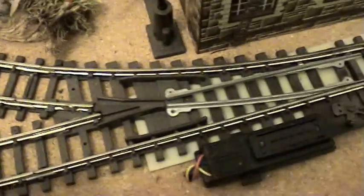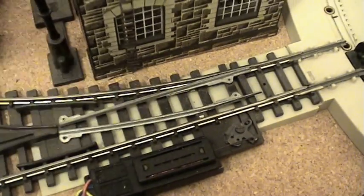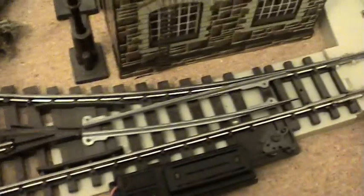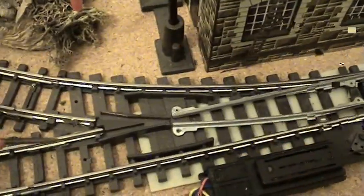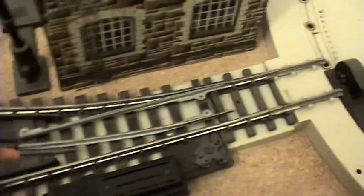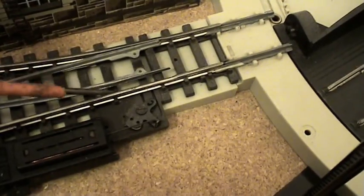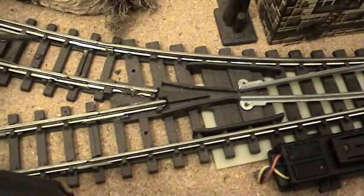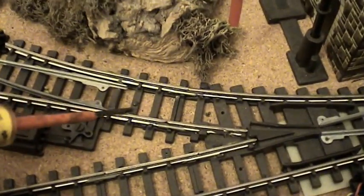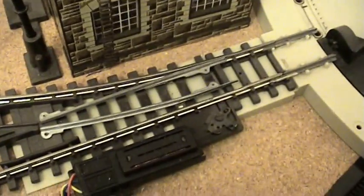But this is the bit I didn't make very clear in the other video. When you switch that back, yes, we've still got the wire from there to there, which doesn't matter, because that's doing exactly the same thing — it is already touching there. So basically what we've done, we've just left that wire there, but because we've switched the point back to the straight position, this bit of track here is now dead. So I did sort of misstate this in that last video — the loco won't run when the point is in that straight position.